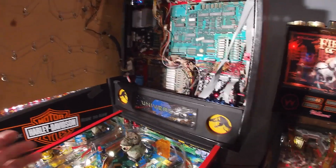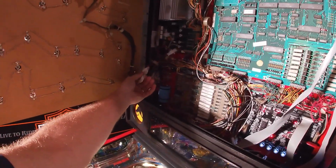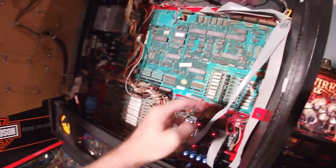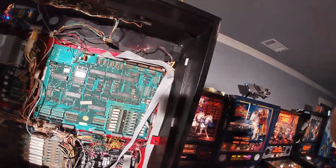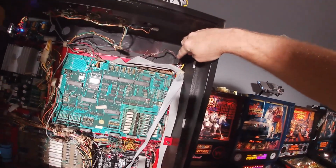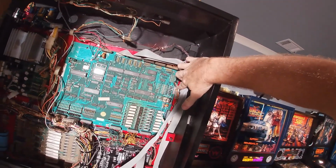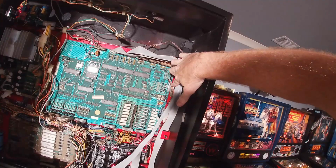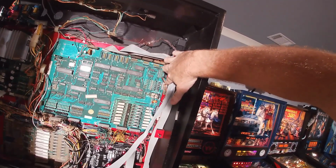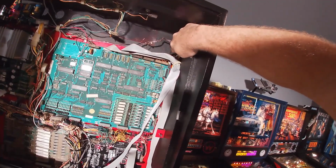And the way I did that was, here's your standard connector, and I've got a one in the center, and these go up to these two relays up here. So I get a good picture of that. The two relays up here hook to a bleed off of this flipper circuit. Whenever the flippers are active, this circuit right here is what's turned on. So I've got a line that comes up from there and goes to these two relays.